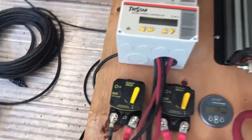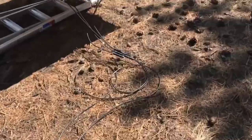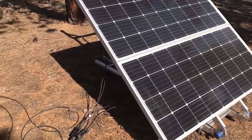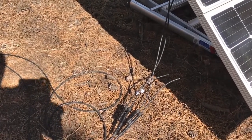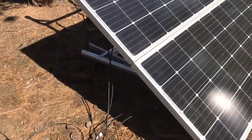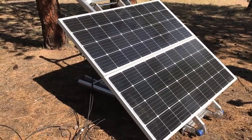Right now this one is running through the cables coming out here. There is around 30 feet of cable. It goes over here to these two solar panels that are currently linked together with parallel connectors. So each of them has the same voltage output, but with twice the amount of current.